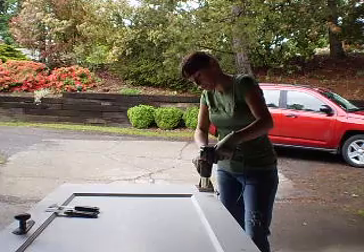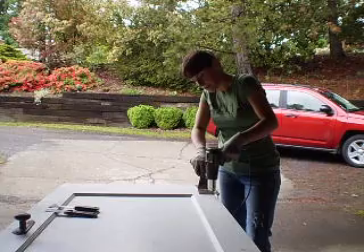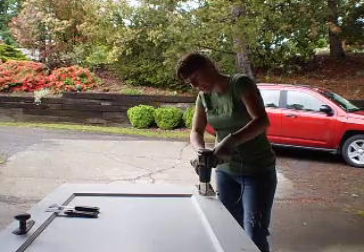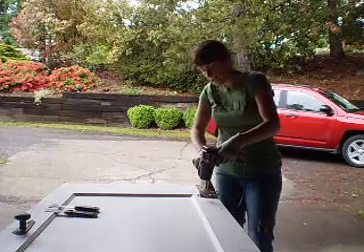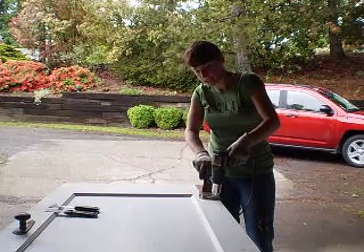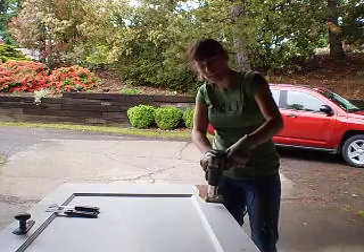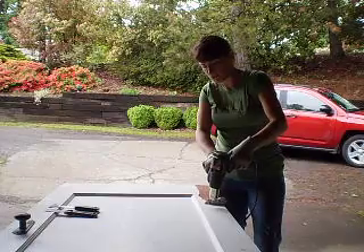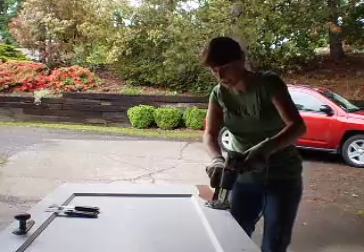The paint all over this door has cracked, and that's another reason that I'm not just sanding. Another reason not to just sand is that a lot of the times the paint that was put on these doors has lead in it, and so by heat stripping I'm avoiding a couple of things. I'm avoiding releasing lead into the air, and I'm also avoiding using heavy chemical peelers, which really, really are unpleasant. I use a lot of chemical peelers — I can't stand them.